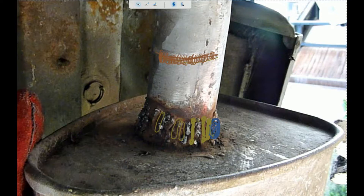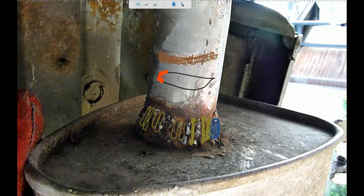There was also a big gash — I can't see it in this picture, but when I turned around and looked from the other side after the first half was done, there was a big gash. I did the same sort of thing: built blobs up, welded them together. I thought this was never going to work, and it did. The heat was destroying the rust as it went along. I built up big blobs, got them close together, and filled up the holes.